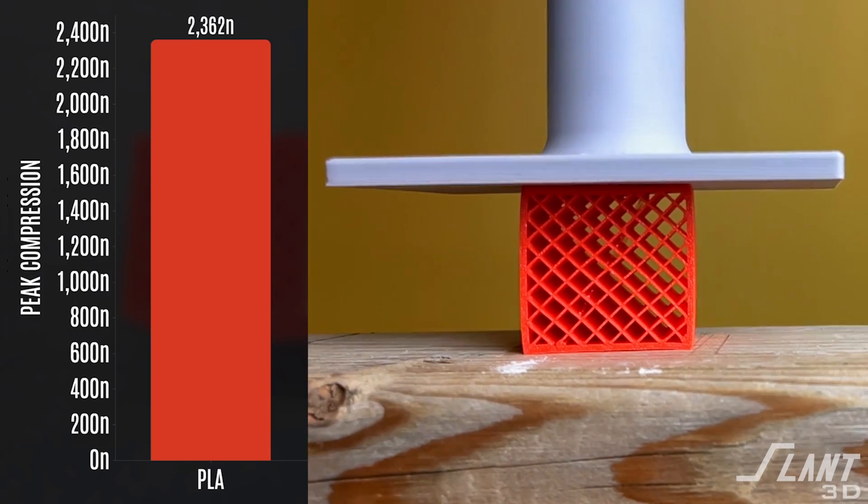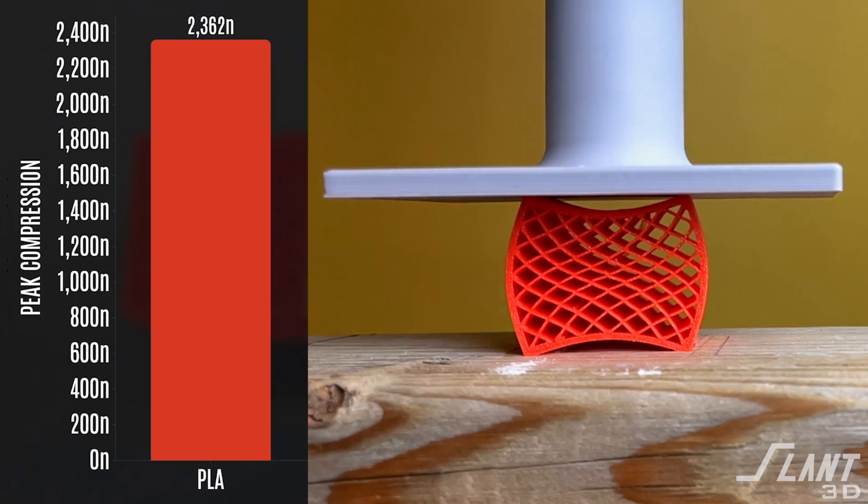So there were probably a number of surprises in that batch of tests. A lot of people probably did not expect PLA to be that strong, and probably did not expect nylon to be that weak. Now PLA is an exceptionally rigid and stiff material — it has a high compressive modulus. So even though it's generally considered a low-grade material because it is affordable and easy to print with, it's exceptionally stiff, which means it's also exceptionally scratch-resistant and tough in compressive loads. So if you're making something that's a brick or block, PLA is a very performant material, so long as its other characteristics — like low heat tolerance — are also viable.